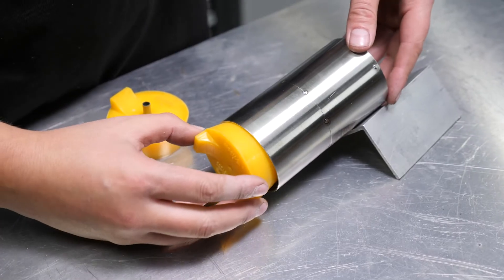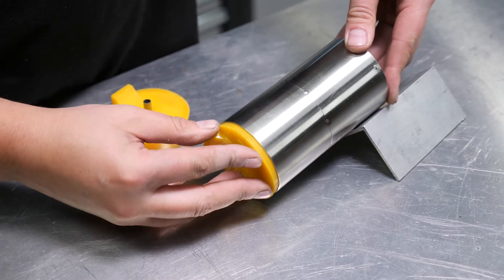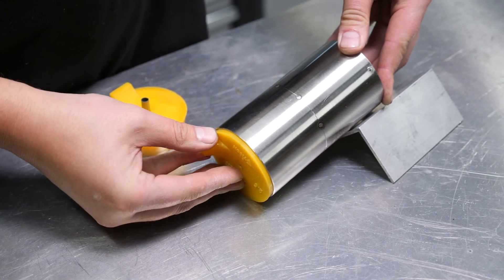With the parts tacked, we need to seal the open ends of the tube ready for the supply of our purging gas. There are plenty of options including aluminium foil, masking tape, aluminium bungs or dedicated silicon purging plugs. If the weld seam is more than about 25mm away from the open end, then a silicon plug is a viable option.